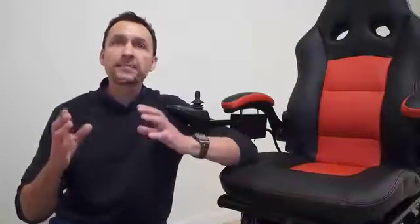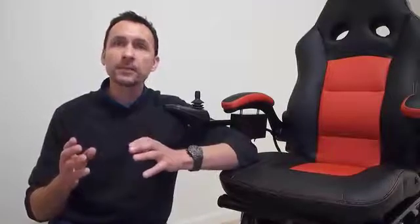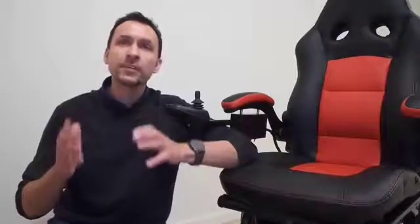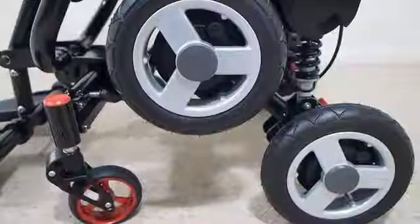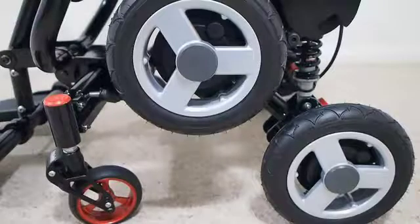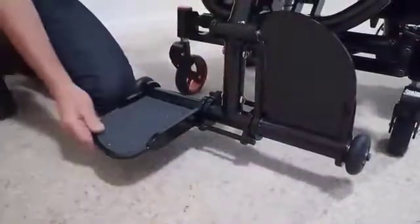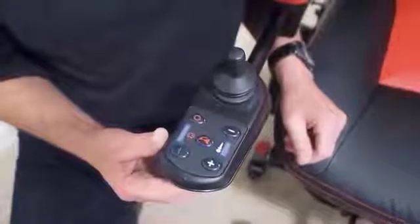The prototype of the chair in the upright mode has a wheelbase length of 450 millimeters, seat pan to floor height of 480 millimeters, and has a width of 600 millimeters. The overall length is just under a meter. The two rear drive wheels and two front casters sport independent suspension, and the footrests can be pivoted up together or individually. A standard joystick controller controls the chair.